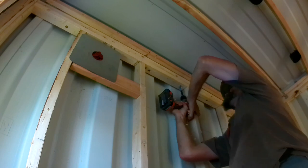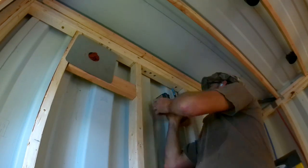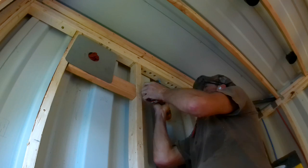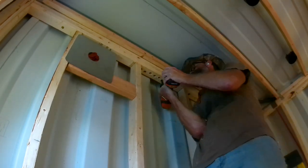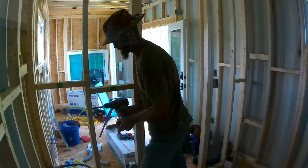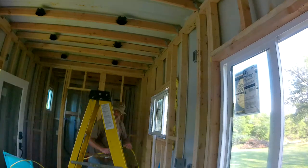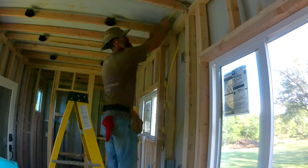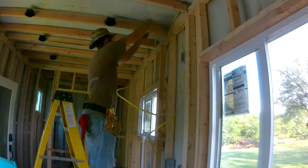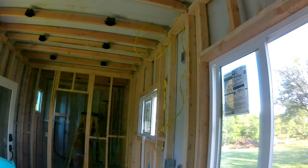Once I got that run, you've got to drill all of these holes. The panel is down around my waist and everything is just gonna run up through the framing of the rafters — a whole lot easier, especially since there's a gap between the rafters I put in and the actual roof structure. Drilling through these studs is not exactly fun. I tried these Spider products throughout this project and I am not a fan — the hole saws, drill bits, things of that nature are cheap for a reason apparently. I ended up switching to a spade bit, just an Irwin wood spade bit, and it worked a whole lot easier. The only downside is if you hit a nail, which I did, it's done.